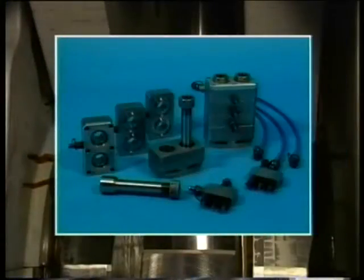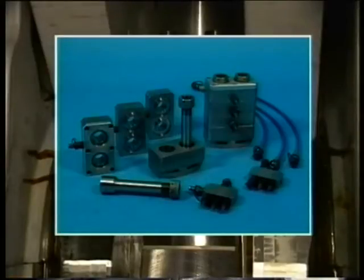To allow all four studs to be stretched simultaneously, three super-posed jacking elements, so called triple-triple jacks, are used, which jointly provide the required tensile force.